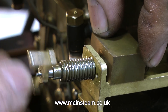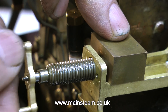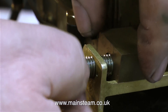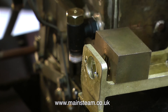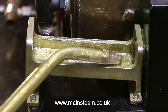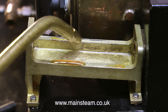When Phil and I first looked at this engine, it looked like there was a single point screw just going into the threads, but we were wrong. This is beautifully engineered and it's a phosphor bronze block — it's not brass. The fit is perfect: it's not too tight, it's not too slack. So what went wrong with the design and the basic thought process that puts a perfectly square block onto a carriage that has rounded edges? I don't know.